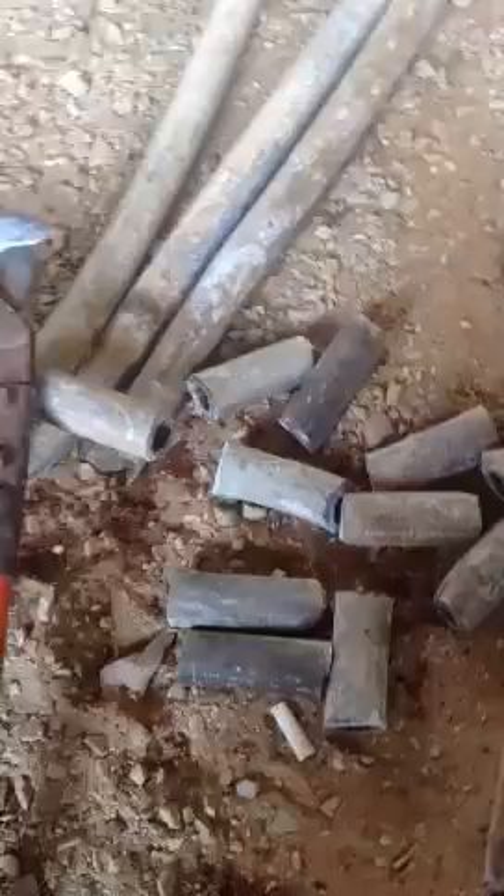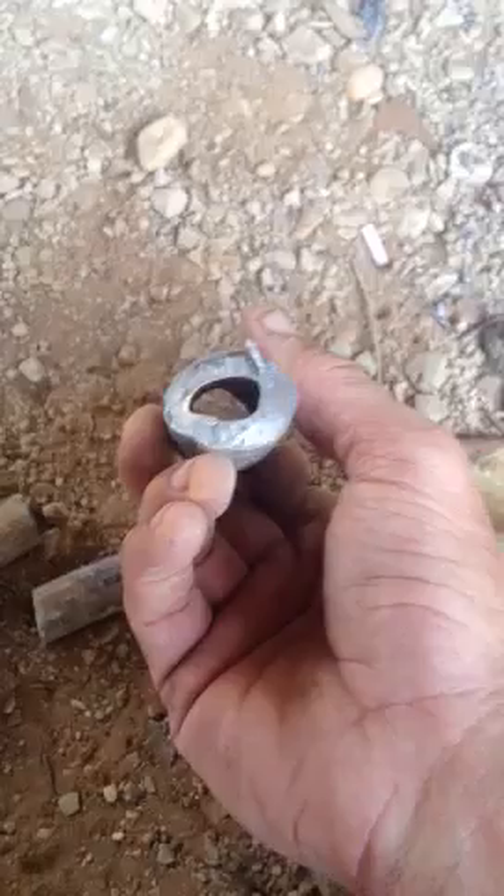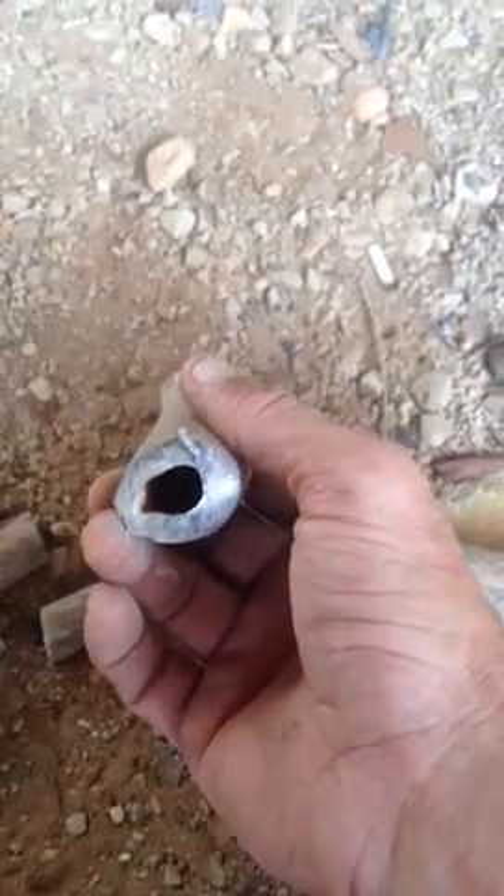You can see all the crap on it and inside. Some of these pipes actually have dirt inside, so if you use water pipe you can flush it out with a hose and let it dry - that's great. If not, try to avoid moisture, because if you get water dropped in that lead you're looking at a serious explosion as far as the amount of lead that's going to pop out. That moisture burns off fast.